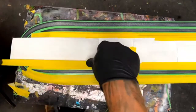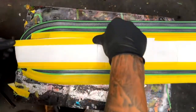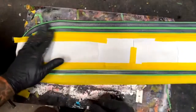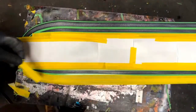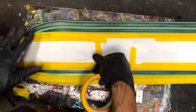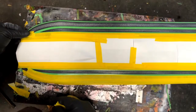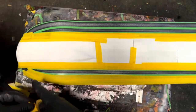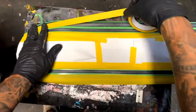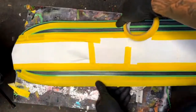John said, I bleed and run everything you can, but a light coat seems to stop all the bad things from happening. Yes, and that is definitely correct, because light coats can help contamination problems. Like if you put your first coat on and you notice a bunch of fish eyes, it probably would have happened anyway, it just wouldn't happen as bad. If you're going to have a fish eye problem because of some kind of contamination, it's going to be intensified if you apply heavy coats at first.